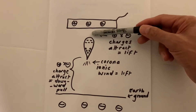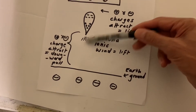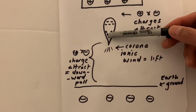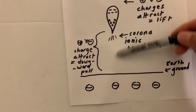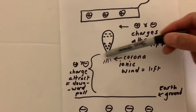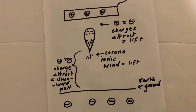That creates a very concentrated positive charge on the pointy tip, which generates a corona discharge and forms an ionic wind. You get attraction here which lifts it up, and an ionic wind blown off there which also lifts it up. Then the positive charges in the bottom part of the foil attract the earth ground, giving a downward pull. If you can balance the downward pull with the upward lift and the upward positive attraction, this thing floats in midair — which is what you're seeing here.